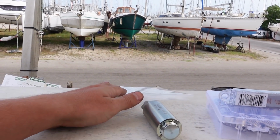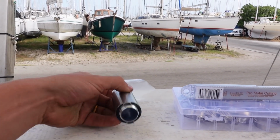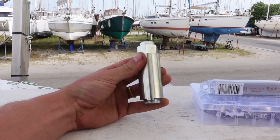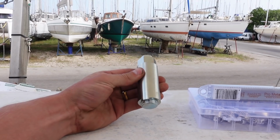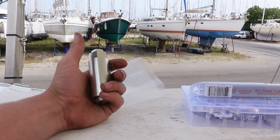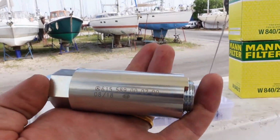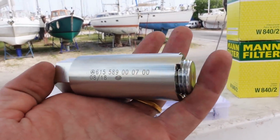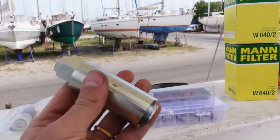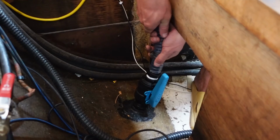that was about £55 without tax and without delivery, and this is the special tool to screw down the injector or the pre-combustion chambers to hopefully stop leaks. Hopefully that'll do it. That was £65. It is the official Mercedes part, and it is very, very difficult to find. Basically it's a castellated nut screwer. Lots more progress can be made over the coming days.